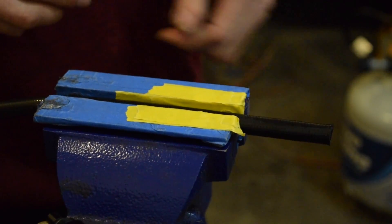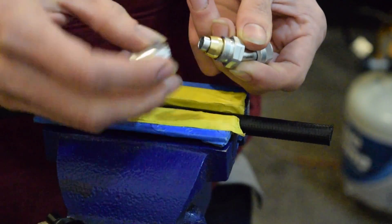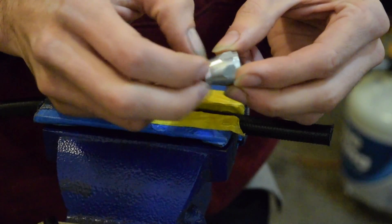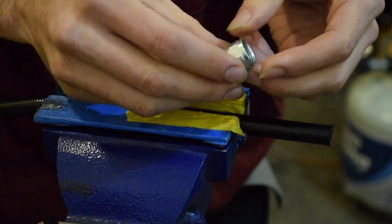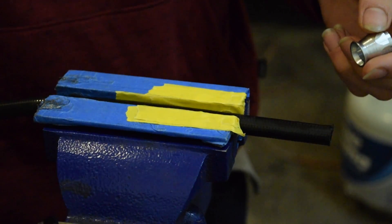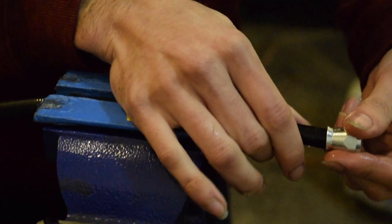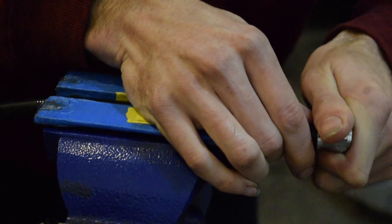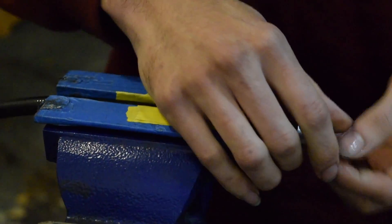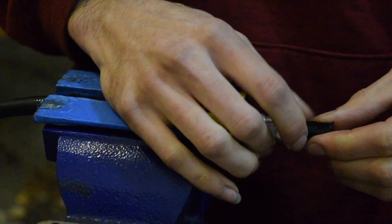After you have the end of your hose cut off, you're ready to take apart your fitting. Put the back half of the fitting onto the hose first. Take this and slide it with the lip facing the hose and the threads facing away from the hose. Add a little bit of water here to help it get on there — smaller hoses slide on a little bit easier than the bigger ones. Slide it back about an inch, inch and a half.